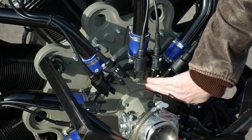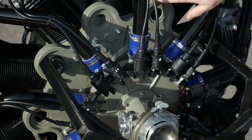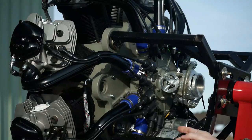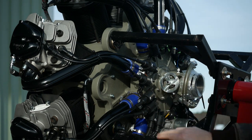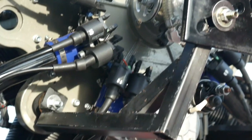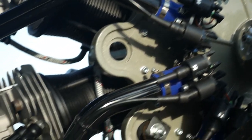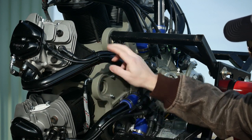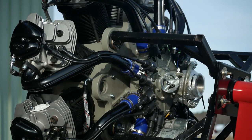Here's the throttle body and the blower — a mixing blower inside that sends the air-fuel mixture out into your intake tubes to your heads. Here's another view of the throttle body with the throttle connection point. Here's the high torque starter. The intake tubes and coil packs, and here's a view of the mount — eight mount points using rubber bushings as part of a kit of eight.